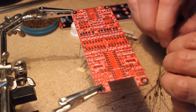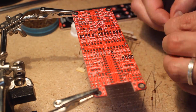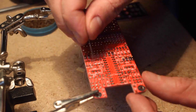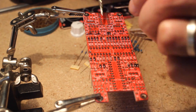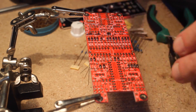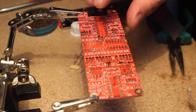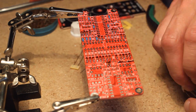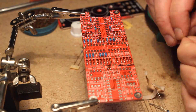The Chopping Kinky is a wave folding module with some very interesting capabilities. It's actually two wave folders with slightly different profiles and a switching circuit, which can make for very interesting timbre and rhythmic effects. It has separate inputs for each folder, but they're normalized together so you can use the same source for both. It works with audio as well as CV and has three outputs — one for each folder and one for the switching circuit. You can use the folders in series or parallel, and they also work as VCAs since at minimum setting they're silent.